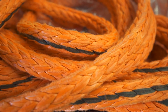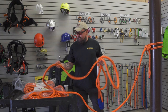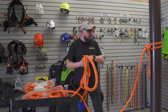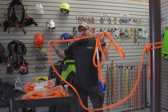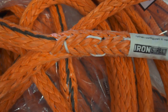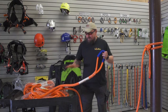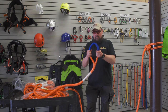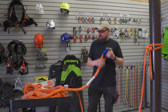This is a 12-strand hollow braid, Class 2, which is comprised of Dyneema SK78 as well as what they call their DPX technology — a polyester strand. What this polyester strand does is give us more friction when we're going around the cylinder. These slings are rated at just over 7,000 pounds, specifically 7,051. It has an OSHA-approved rated tag with the manufacturer specs and the splicing specs. On our 30-footer in our standard kit, this is the long sling, ID'd by the blue chafe sleeve as well as red at the end. The rating is based upon tying a cow hitch around the cylinder.